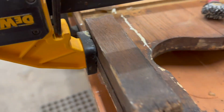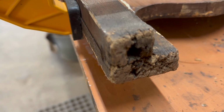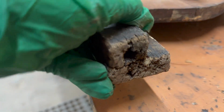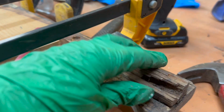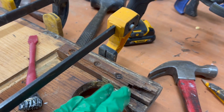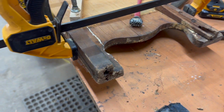They're pretty beaten up. So I'm gonna actually take these off and replace them because I don't think that they're gonna hold the weight of the cabinet very well. They're all kind of rotten on the bottom. This one's loose and it's been screwed on there. So we'll replace these, put some nice blocking in later so we can attach some feet and protect the base